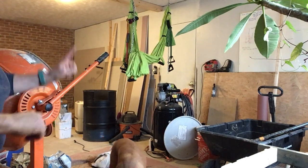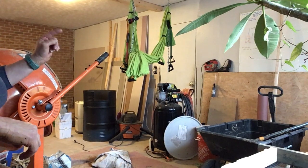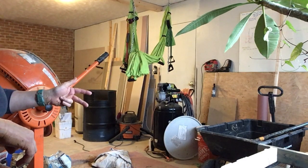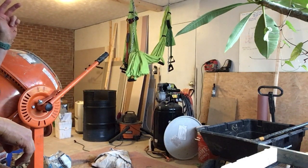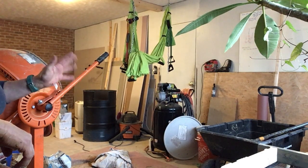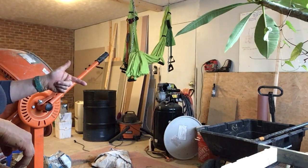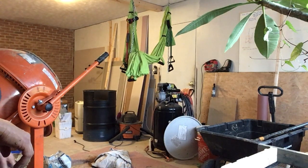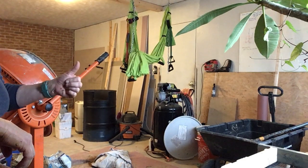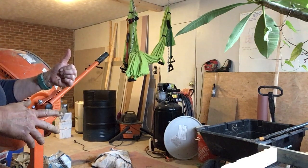And then the form for the heat riser will be perlite and Portland mixed with wood ash and aircrete, and then sealed with sodium silicate. So it should prove structural, insulative, and refractory at the same time. As it goes up, it will be super hot. By the time it hits the top of the bell, it should be probably around 1,200 degrees. I don't know.